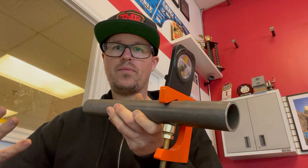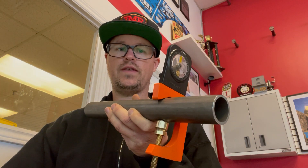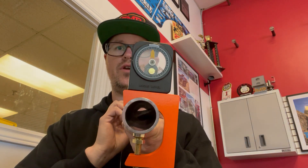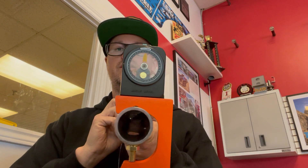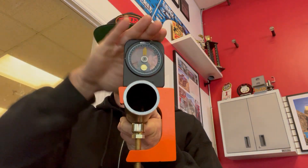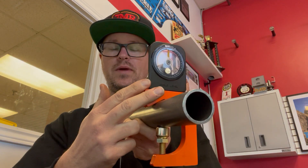A plane of bend bracket, or tube rotation gauge, functions by attaching it to your tubing. You can then load this into your tubing bender, notch, or whatever you're working with. Basically, tension your bender set up for your notch and put an angle finder on here — it works with anything that's magnetic.